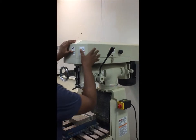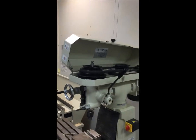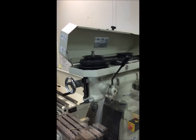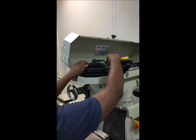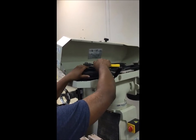Then you're going to have to open the top of the vertical mill to expose the belts. Once you've found your wrench, you slide it over the bottom bolt and you twist it away from you while you twist the pulley in the opposite direction.